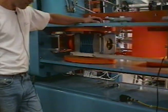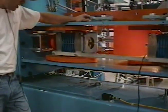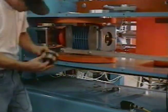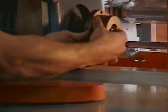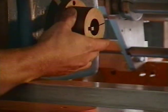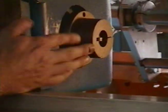Now we're getting ready to put on the middle shaft that's going to connect both gearboxes together. We take our QD bushing and start with the gearbox closest to the motor. I'm going to apply my QD bushing with the step key. You notice this shaft is smaller than this shaft, so you want to get as much shaft inside this as you can. I'm going to bring it right to about where it meets the fan shroud here.